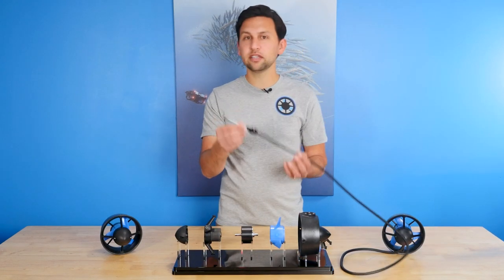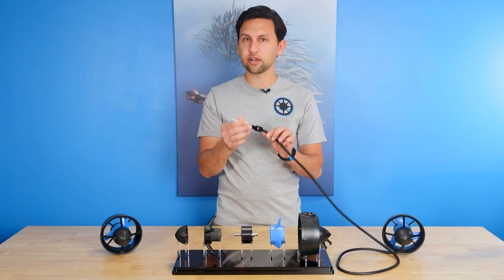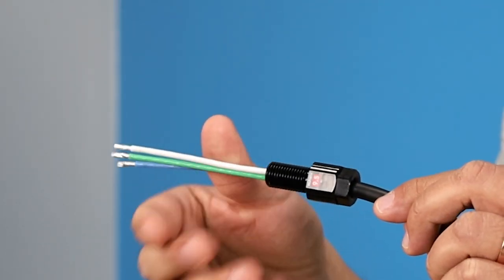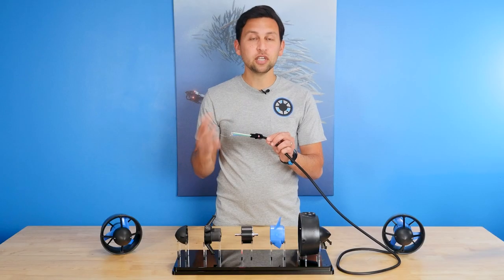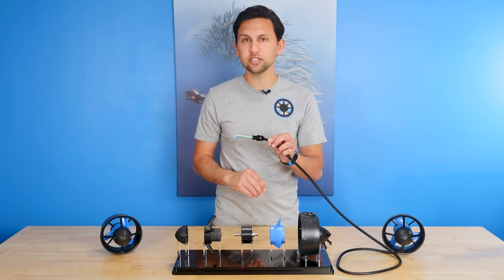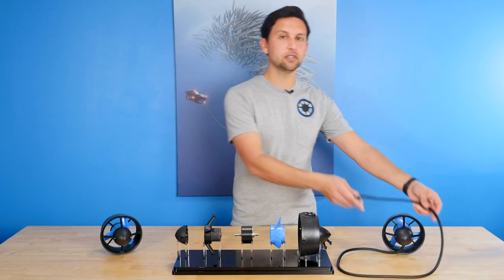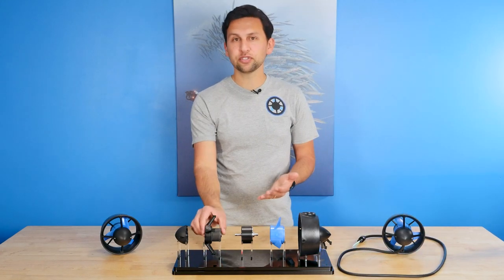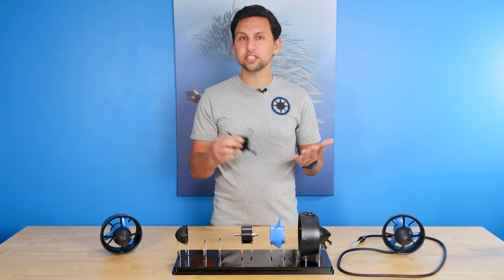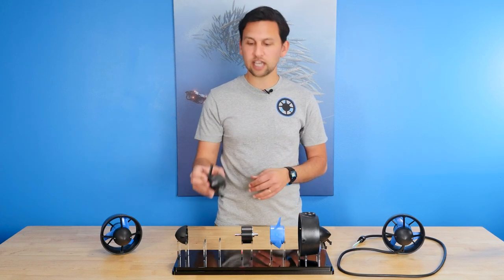A durable polyurethane cable comes out the other side and has three 12-gauge conductors, allowing for constant full-throttle usage. On this end of the cable comes a pre-installed 9.5 millimeter wet link penetrator so that the thruster is ready for high pressure. You should note that this penetrator has an M14 thread size, so it does require more space and larger holes in the enclosure end caps. We will have some compatible end caps available for our enclosures in the future. Each thruster core is laser-marked with batch number and quality traceability information, and data is logged and checked throughout the production process to ensure consistent, high-quality standards.